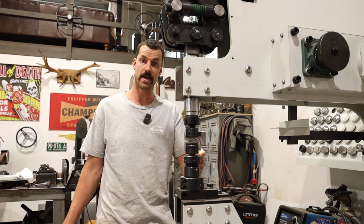So right now, all I'm doing is using a flat sort of T-dolly, and I'm kind of just massaging it this way in order to create just a little bit of form. You can already see that it's kind of coming this way now. This corner bit is really coming together, which I'm kind of shocked it was gonna work. Maybe trying to get a bit more depth in here, because obviously this bead is way deeper than the one that is on the wheel lip itself. So I'm just trying to kind of make a nice transition and then just try and smooth all this out here.